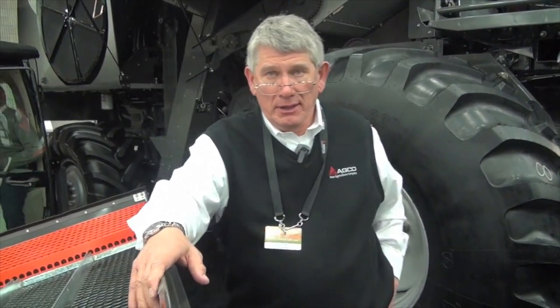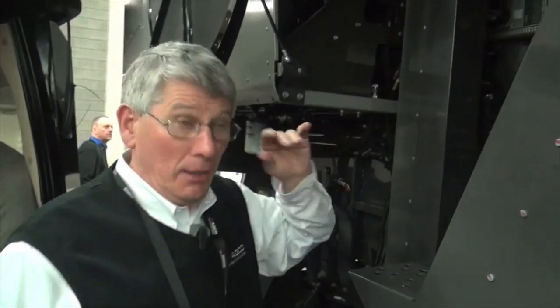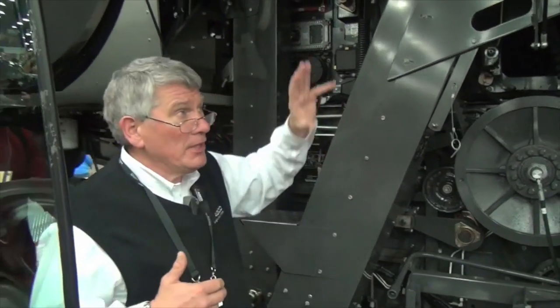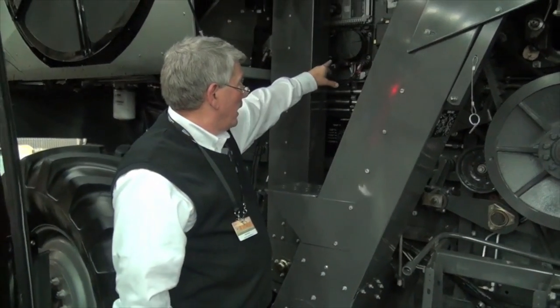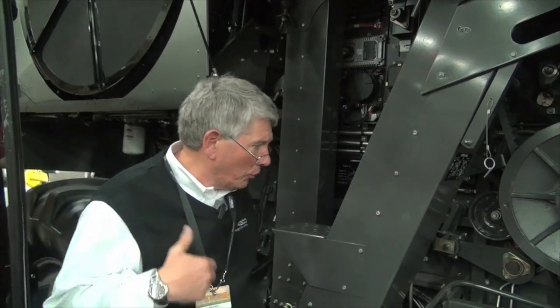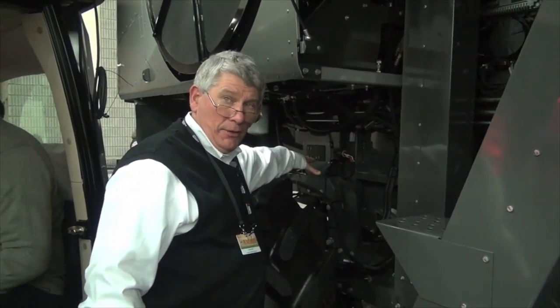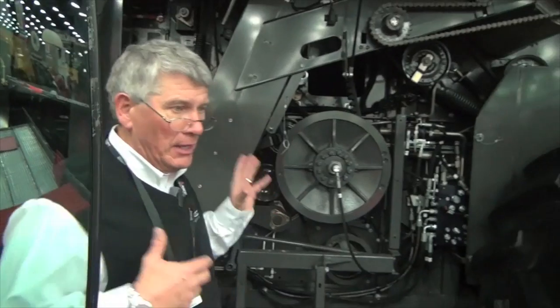As we walk back in the combine, you're going to see a major difference in electronics. You'll see a lot of things on the cab we've incorporated. We've done away with the EIP up in the cab roof, and that whole area has been opened up. Now you'll see a lot of use of what we refer to as VMMs and MVX on the unit. We've gone more to electronics to make it easier for the customer for adjustments. You'll also see a pod located at the rear where you'll find electronics for things like chaffer and sieve adjustment, lights, and so on, conveniently placed for easier operator access.